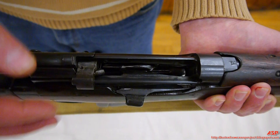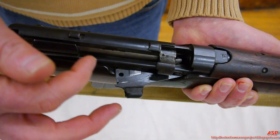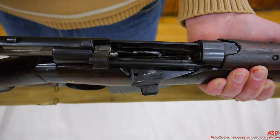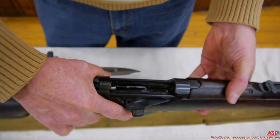When the situation comes where you need a high rate of sustained fire, you reach over and remove the cut-off. This allows the bolt to move up just enough to catch the edge, so when you bring the bolt forward you start peeling cartridges out of the magazine — up to 10 shots. Then you reload the magazine, place the cut-off back, and you can fire it 10 times.